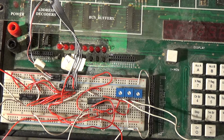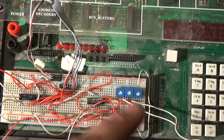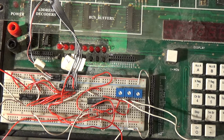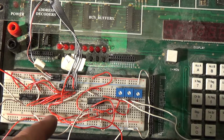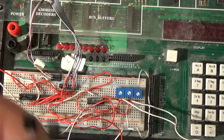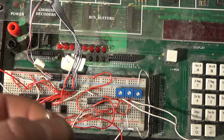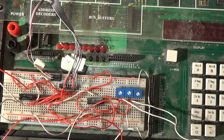I'm going to get 3 little transistors like this, and the Z out, the normal Z out for your VECTREX, is going to give the power to these 3. I have 2 in my hand, but these 3 transistors. And when I get a signal to the base of these transistors, that will turn on the intensity. Depending how much power is given to these transistors from the Z intensity, I will have my colors. So, in a half digital, half analog sort of way, this will give me 256 possible colors.